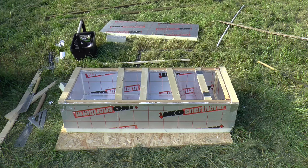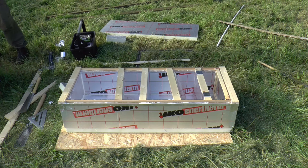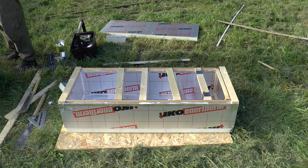This aluminium tape is really very effective, and that would be a case, I would say, for using a wider one. I'm only using the 50 mil wide tape, and I would say the 75 or even the 100 mil wide version might be better in some places. The 75 mil is quite easy to manage. Honestly, we probably wouldn't go wider than that because it does become difficult to handle after that size. But 75 mil would work nicely because it would just mean one layer of tape would overlap both sides of a 50 mil edge.